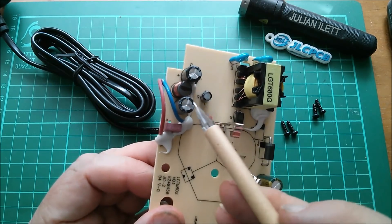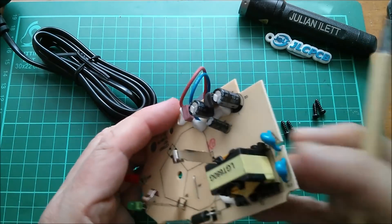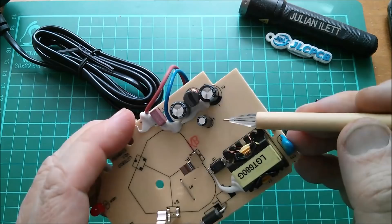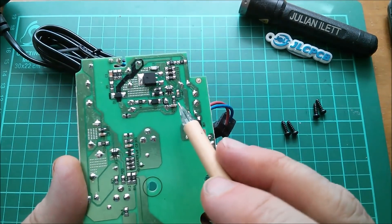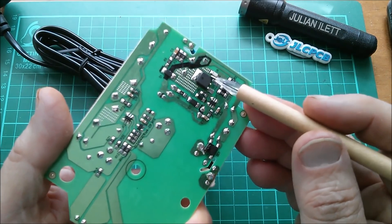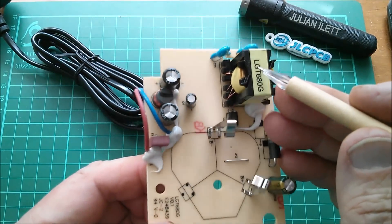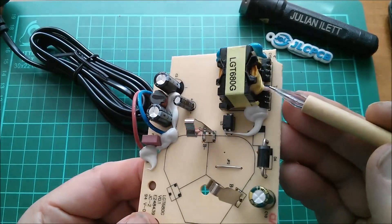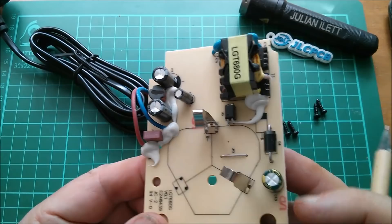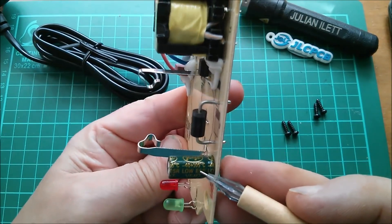We've got a capacitor and an inductor, then another capacitor. There's no NTC here, so there's no inrush current limiter — but then maybe you don't need it with such a small cap. We've got 10 microfarad 400 volt there, and another 10 microfarad 400 volt. On the bottom we've got a BD1 bridge rectifier. There's a Q1 transistor — probably a MOSFET — and a little 6-pin controller chip. There's a big inductor here, which is the main switching transformer to get from high voltage to low voltage, and an opto-isolator for the feedback loop. A big diode stood off the board because it presumably gets warm.